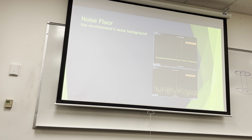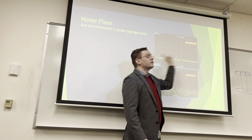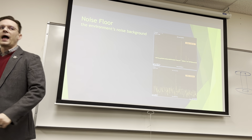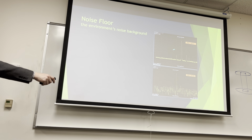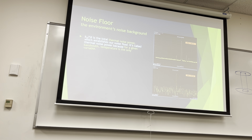So if you want to look at a VNA, for example, and you're looking at a log mag plot, you're trying to see stuff, and you set it from its lowest setting to the maximum, you can't really see a lot. You have to window it in and window it in and window it in, because what you're also missing out on is how many samples there are per window. And I don't care what's happening at 200 kilohertz if this is a 70 gigahertz signal. So I don't need to set that window.